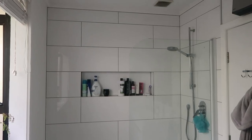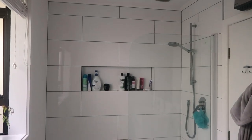The reason that we have left the gib up on this wall is because this is the wall the nursery shares with the bathroom, and about in the middle of the wall is the recess shelf that we made in our shower. We didn't want to risk taking the gib off and putting new gib up with banging the nails, just in case it cracked any of the tiles and made anything in the bathroom not waterproof. So instead we're going to put new gib straight on top because there's a bunch of dents in the wall we don't think we can get out with plaster — we're just going to double the gib up on this wall.